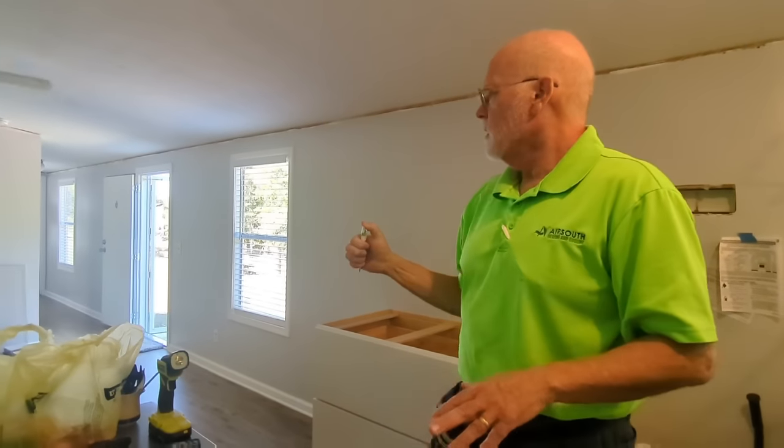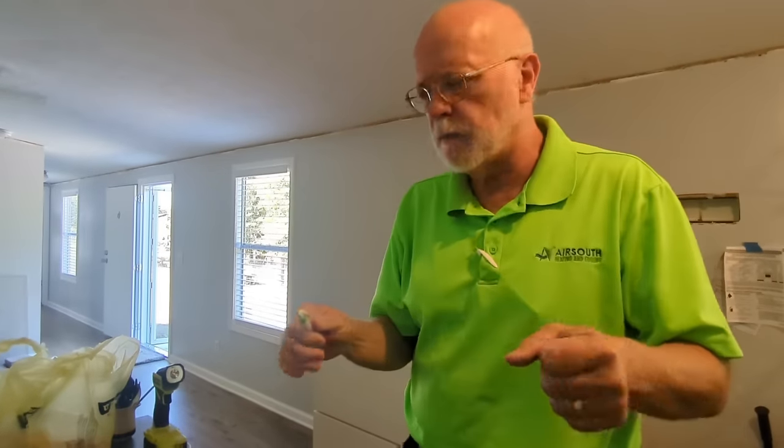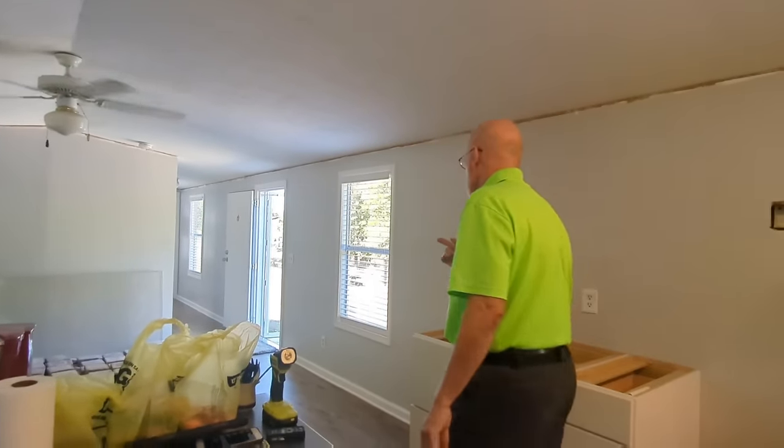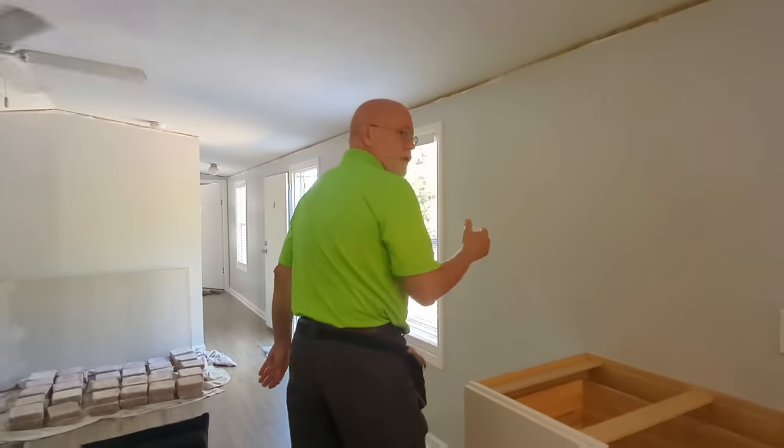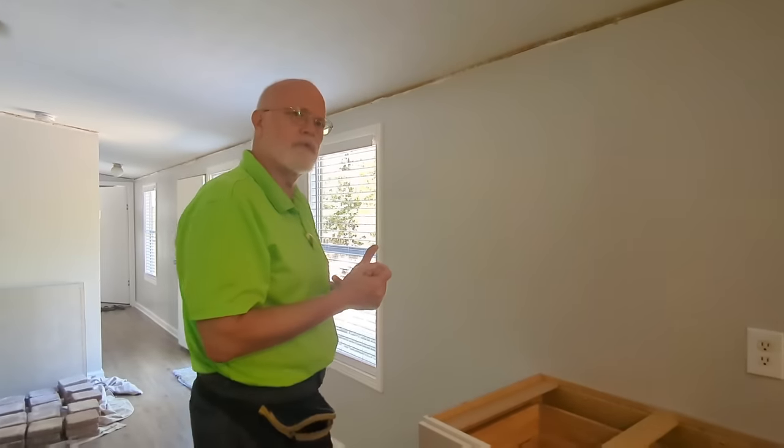Right. Exactly. And this is where you're going to get a lot of utility out of it. Now, the disadvantage of a mini split, and you probably already know this, is that it only blows air from where you have it mounted on the wall. Yeah, that's the deal. So it has to circulate. That's right. So you kind of have to think strategically. Where would I want to place these? So I'm thinking now. You could theoretically put, let's see, probably no more than 3. I'm trying to figure out a way that you could do 2. Let me give you a strategy.